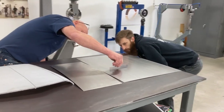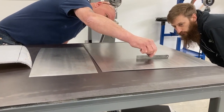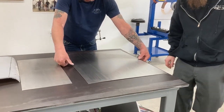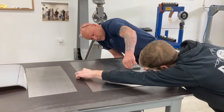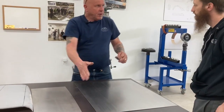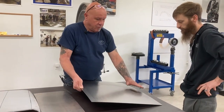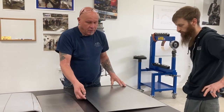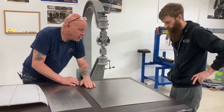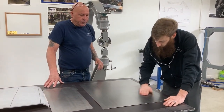There you can see we don't have too much shape going in, just a little bit. As you hold your sides in — if you hold these two down — you'll see exactly how much shape we've got, because the flatter the panel, the more crown that comes up. The more you allow the panel to bend like this, the flatter it goes. So we're holding it fairly flat. You can feel the panel and tell whether or not we've got too many ribs or not many ribs.